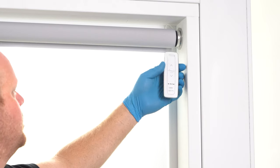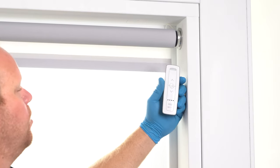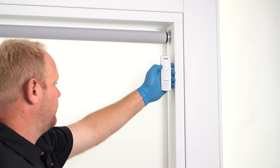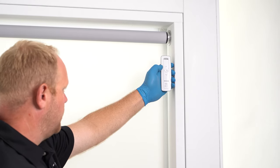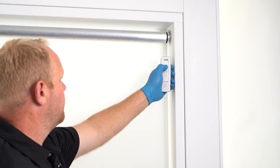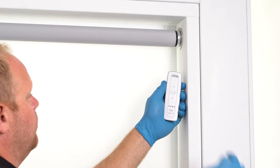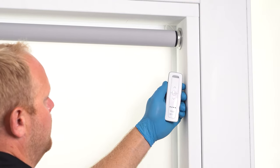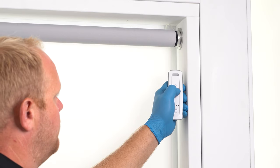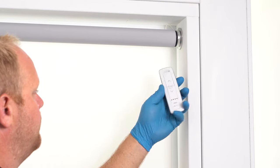Get the motor into position. For the top limit, hold down and My — it'll set the limit. Once again, we want to roll it out a little bit past go so it has natural weight on the tube itself. You can roll it down to bare tube if you prefer. Now to set the bottom limit, hold up and My. Now the limits are set. You can hit My to stop it, and to get it out of program mode, hold down My for one jog. Now this motor is set up to channel two.